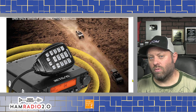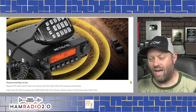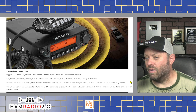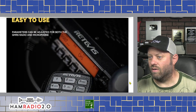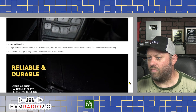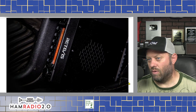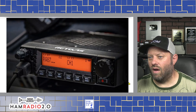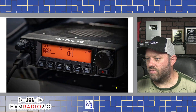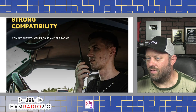40 watts is good for a mobile radio. Anytime you have 40 or 50 watts on a mobile radio with an external antenna on your vehicle, you're going to get out a lot farther than talking on a handheld inside the vehicle. It's got a nice-looking microphone with a DTMF pad on it. Vents and fuse aluminum plate for effective cooling. That's a close-up of the screen — it's a really good-looking screen. You can see the VFO and the MR memory recall button on their website.